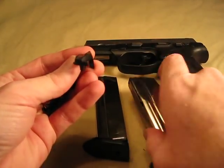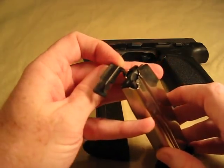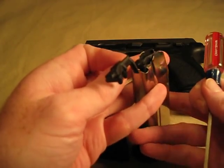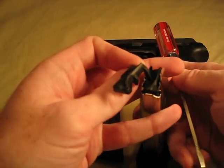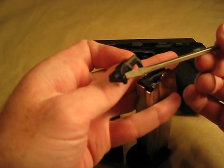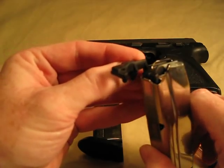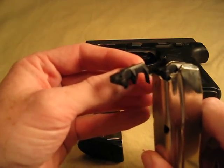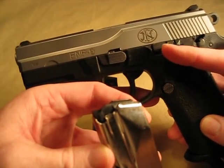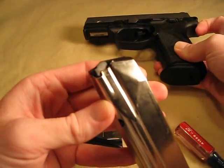These actually go up in the top of the magazine and this section right up here on the front is what's actually different. Let me try to compare them side by side here. I've already changed them, so this will just kind of show you what it's like if you have some you want to change. There's the new one — as you can see this section is built up compared to the original. This section is a little bit lower, so that's the main difference. Basically they're the same other than that. That one small difference is important because when the magazine is installed, this section is what actually pushes up the slide release on the inside, which is what's going to help keep the slide locked back.